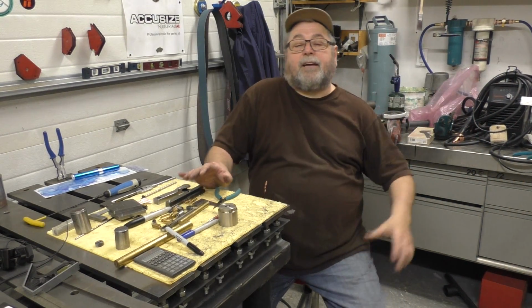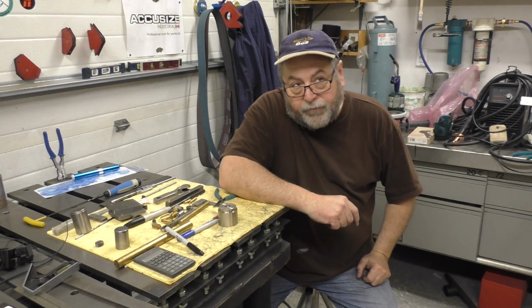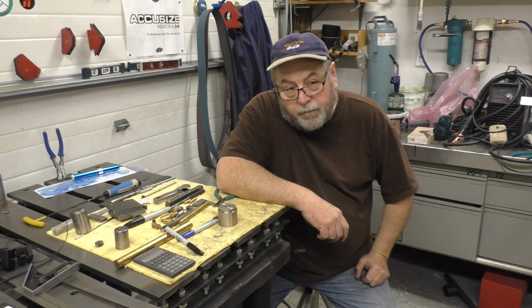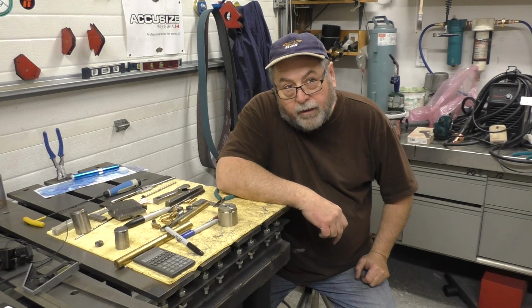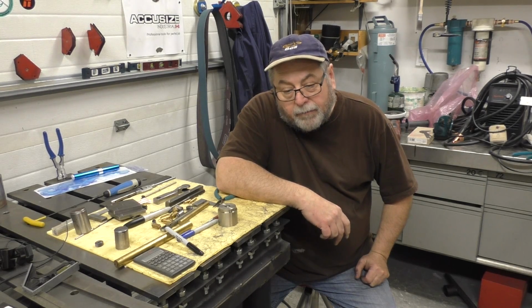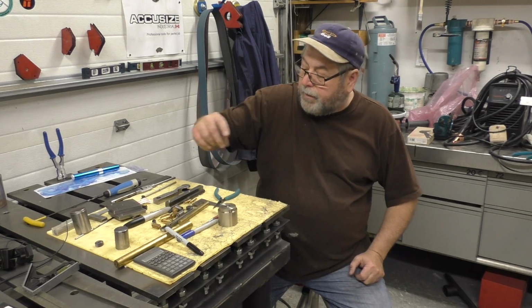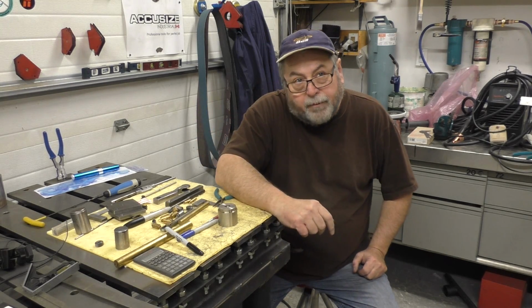Hey guys, we're back, and we got the heater working. So a few components had cold solder joints, and one, the main power where it feeds the main relay. Yeah, it was a cold solder joint. It was arcing. You can see the little black spot around. So that's all soldered up.